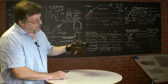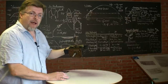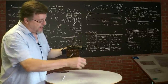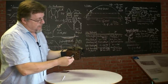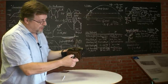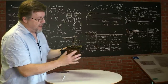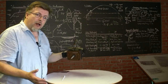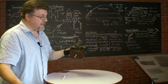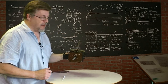The way to picture this working is probably pointing down at roughly this angle in the equipment bay, behind the spring-loaded flap shown earlier. The socket would go onto this spring-loaded spine — there would be two of these, the other one next to it. At the appointed time after engine fire, the electromagnetic catches would release, the spring would drive the socket away from this face, and then gravity and the loading of the boom carrying the cables would allow these to simply fall away. The spring-loaded cat-flap door would latch down behind it and the rocket would be on its way.